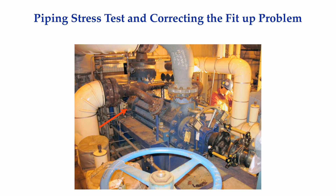We then measured the gap at the discharge flange faces, kept notes, and discussed how we were going to correct this. Since the gaps were not excessive, we decided to alter the alignment correction moves to not only align the shafts but also fix the piping fit-up problem. This will be discussed further in one of the intermediate alignment tutorials.